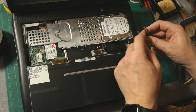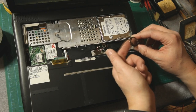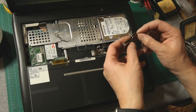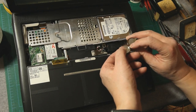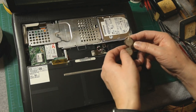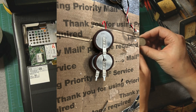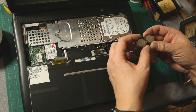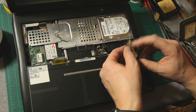There's a red wire on top. There's a white wire coming from this middle area, and then there's a black wire welded to the bottom. So this is the original, and the original batteries had these kind of welds on them. I guess this is some very thin piece of aluminum or some conductive metal. And the new ones I bought, which you'll see a photo of, have these tags that are also kind of welded on. But when I wanted to connect to the batteries, I wound up using the tags and soldering them together.